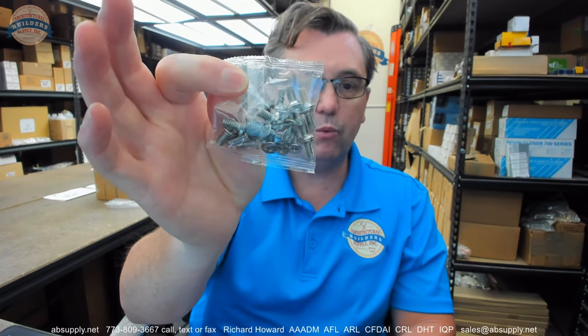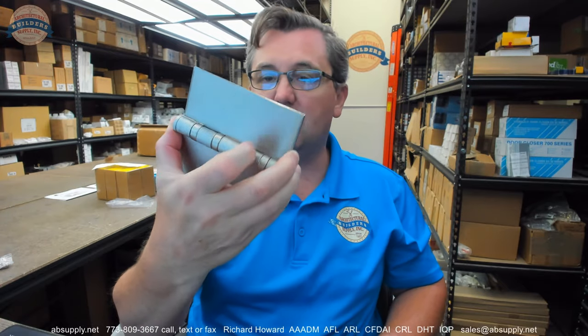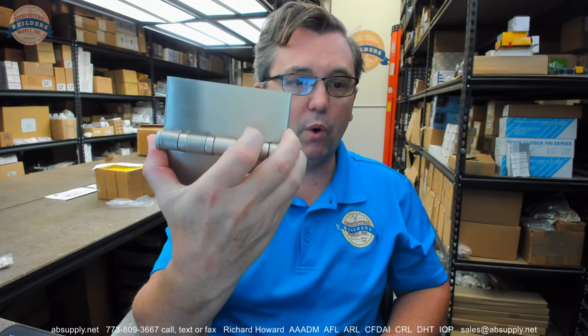Let's switch to the screen view and take a closer look. The rest of the part number is TMS — that stands for template machine screws, the proper nomenclature when you want machine screws. And then 630 is the solid stainless with a brushed finish, which happens to be the most durable of all finishes — it's called a natural finish. All we've done is taken that base material and cleaned it up with a very light brush wire wheel. Let's switch to the screen view and take a look at the supporting documentation.